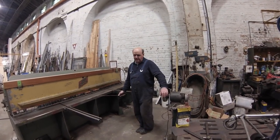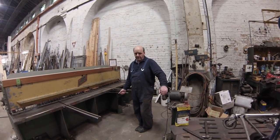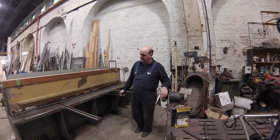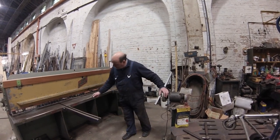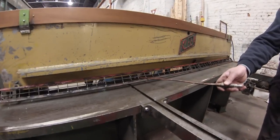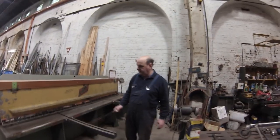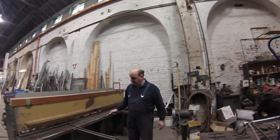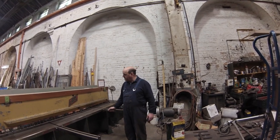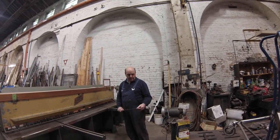We had a lot of difficulty getting the power ram out. The power rams on the back were leaking, and we sent some guys out from the group to have a look at the machine before we purchased it. They reported that the power ram was leaking. Also, the hold-down clamps that come down when you operate the press — they come down and grab onto the metal and hold it in place while the guillotine blade goes down and cuts the plate. A couple of them were leaking, so we decided we'd fix it before we put it into operation.